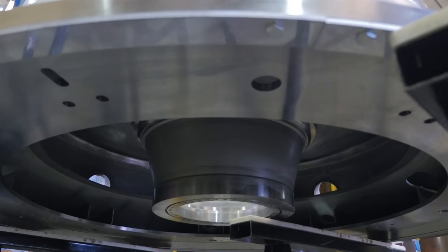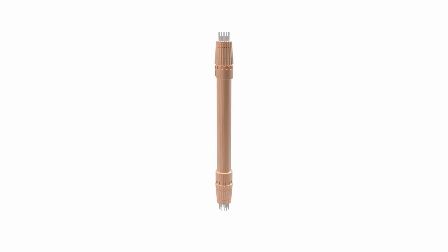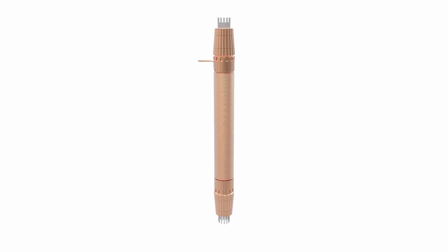You might be wondering what are the main elements of ST40 and how do they come together to form the whole tokamak? This is the center column. It fits down the middle of the machine, and it actually has two parts: the central wedges of the toroidal field magnets, and a large solenoid. The solenoid maintains a current flowing through the plasma, which is important for plasma stability. The toroidal field magnets generate the magnetic field that keeps the plasma confined.